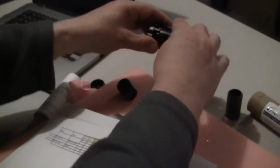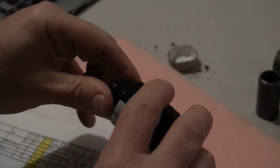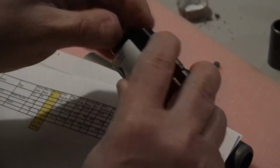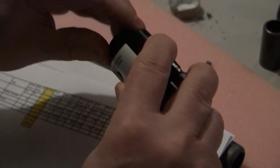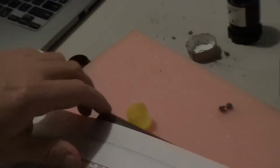So you pull the bit out, kind of dump the extra out, pull it back on 5, put your donut there. I always do one more turn for safety's sake, and I feel now it's just turning and it's not taking any more material off. So that is set up for the delay you want. You've taken 5 out and it's set up for 7.